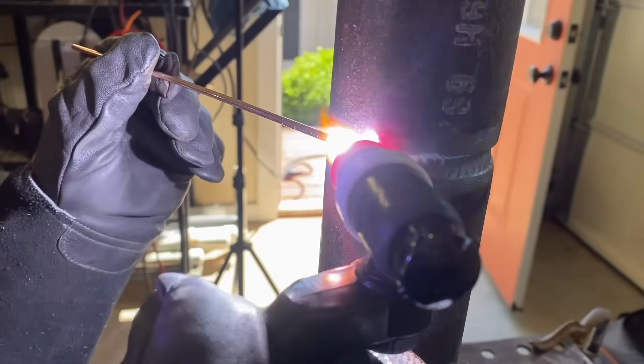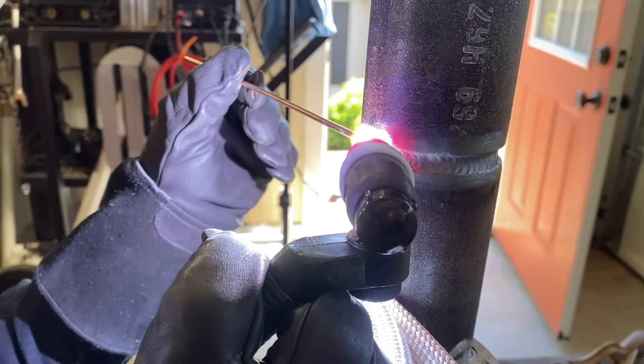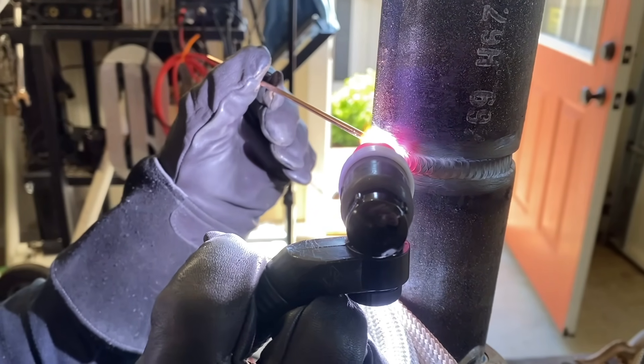Oftentimes you'd go 10, 20, 30 amps hotter even. But the biggest concern is just not to mess up the root pass — not to melt through and suck back. You don't want to disrupt what you've done, you don't want to remelt the root pass, you don't want to melt through at all. For that reason, you kind of don't want to spend a lot of time across the middle. You don't want to jump from side to side — move quickly across the middle, keep the rod in the puddle, and don't hang around in one place too long. Just keep moving.